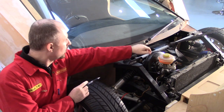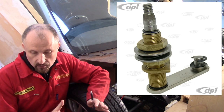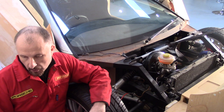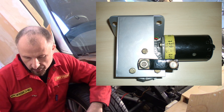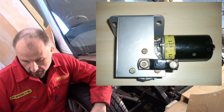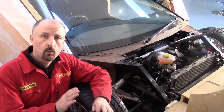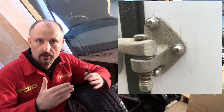So I had to make do with a single arm wiper. I ended up buying a normal off-the-shelf universal spindle, which you can get at most kit car companies and they're not that expensive. I then made a series of brackets to hold the original Audi motor assembly. There's the original Audi motor bolted to a bracket that I made myself, and here are some pictures of the bracket powder-coated without the motor in place. One important thing — I didn't want the windscreen wiper motor assembly bolted to any fibreglass that might cause fracturing or weakness over time, so I wanted it bolted to some metal framework of the chassis.